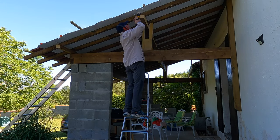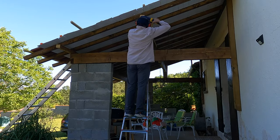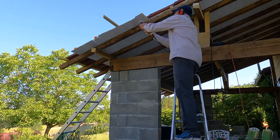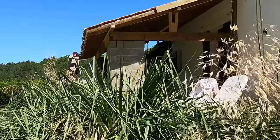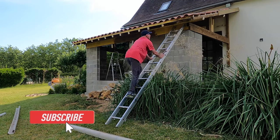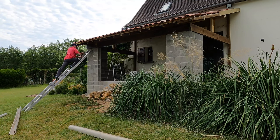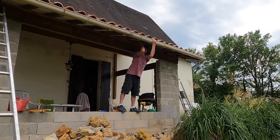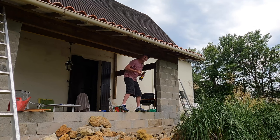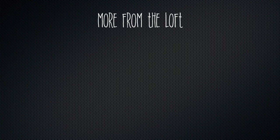So we get to the final day of my holiday — Sunday morning — and I'm just making some finishing touches to the roof and also making sure things will be safe while I'm not around. All the overhanging timbers and beams are trimmed down to their final length, and the tongue and groove boarding is cut back to the rafter. The overhang of rafters is also cut back — all done with my multi-tool. There is still more joinery to do, but that will have to wait for another day, and all this remaining joinery is cosmetic, not structural. Final jobs before I leave: finish the rendering on the bits that weren't done prior to installation, and install some old guttering that came off the house a few years ago — temporarily, but for now it will fill the water butts. That's it — I have a fully functional, if not finished, sun terrace. Thank you for watching, and I will see you on the next video.